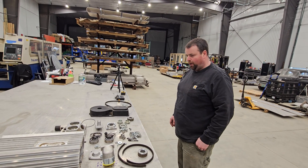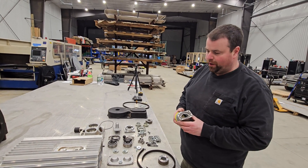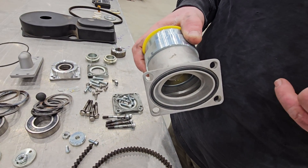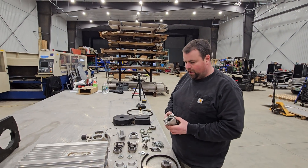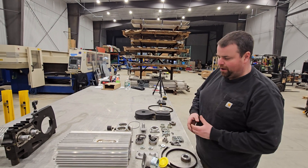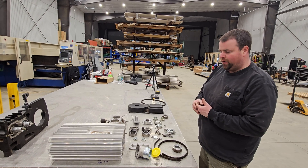Critics are going to say a bunch of stuff went through the pump and you don't know anything about it. But this is the intake of the pump and you can see how crystal clear it is — there's nothing in there. This was in an absolutely controlled environment; I'd eat off that. There is a gas ballast valve in this pump, and it's designed to bring some air into the pump to cool it. Being aluminum, we need some cooling factor, so we're not sure if maybe the gas ballast valve failed.